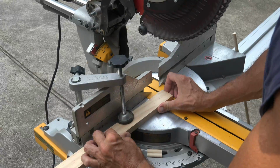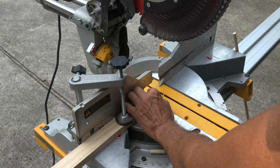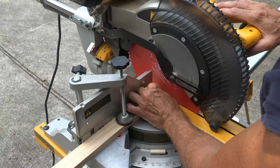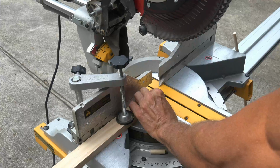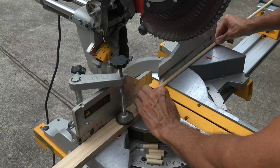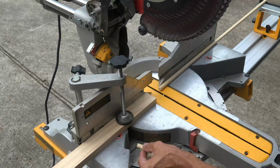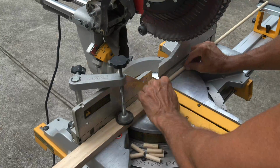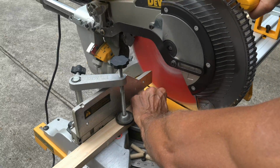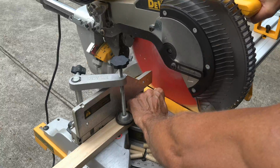I used a 3/8 inch dowel. At Home Depot, these are the ones with the green ends. I cut one at that length and then used it as a template to cut the other ones. I do this by setting up my stop holder on my miter saw and placing the dowel between the saw blade and a scrap piece. Then screw down the scrap piece tight. Using the scrap piece as a backstop, you can now cut as many pegs as you intend to use on your display, and each cut will be identical.